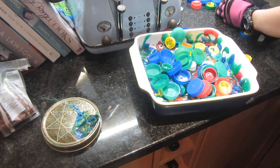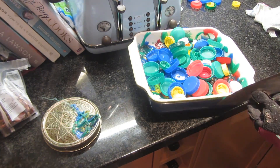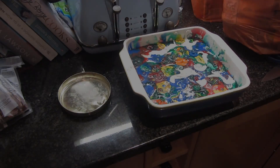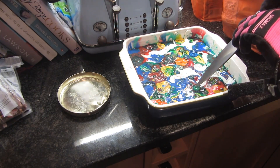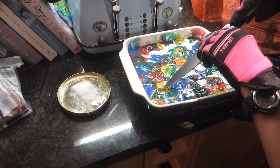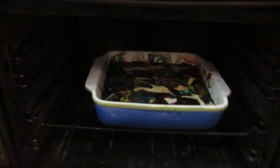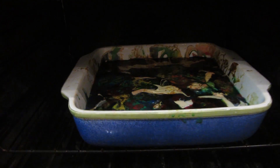Now I'm going to add even more lids to build up more HDPE. As I add the lids I try to make sure they're spread as evenly as possible in terms of colors, because I don't want a clump of all greens or all yellows. After leaving it in for about half an hour, once it's all molten you can see all the air bubbles have risen to the top — that's exactly what we want. If the air bubbles don't rise to the top they'll just stay in the middle and create large voids, which isn't what we want at all. I'm going to put it back in the oven for about an hour, basically watching until air bubbles stop rising, and that's when I know the HDPE is ready to start the cool-down process.